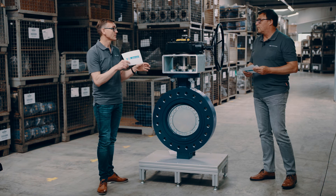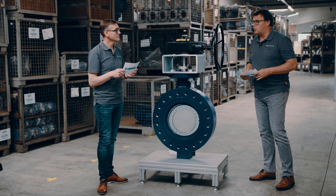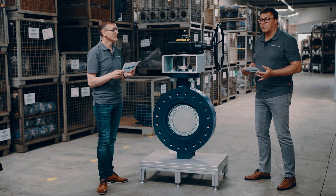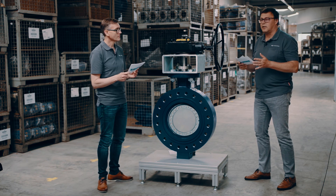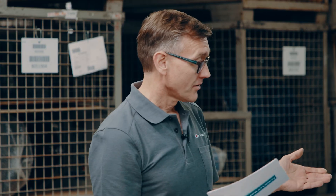We already have a complete package of triple offset valves in different designs and packings for many applications. Are there further developments planned? Yes — the idea is to provide a heat-resistant version rated up to 1000°F, and a new Class 600 weld-end design that provides an additional triple win-win for the client, for example by equipping the weld-ends design with weld-on flanges, making it possible to have a double-flanged valve again with longer face-to-face dimensions.